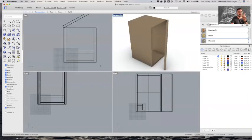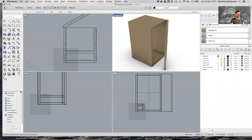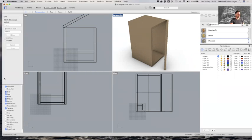Now, the important thing for next week, I want you all to start, and you should use at least 2 to 3 different types of joining materials. Ideally, I would like to make a finger locking joint, use big biscuit joints, you know, you might use screws at some point, but they have to be all solid connections. And important is you need to come up with a cutting list. So, in order to get a cutting list, you need measurements, yeah?